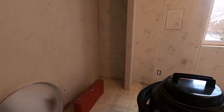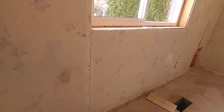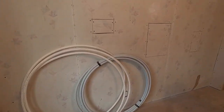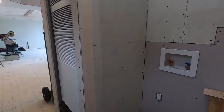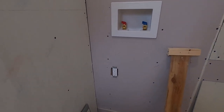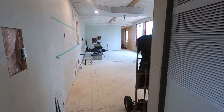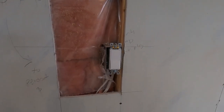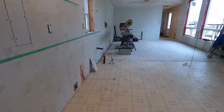We've gone through the whole home and changed out all the old switches and plugs to Decora-style outlets. I usually do that after the first coat of paint, but in this one we had quite a few electrical issues to sort out, so I wanted to make sure everything was correct before finishing the walls. We've relocated the washer plug and the dryer plug to work with our new modern machines. Here we also added a switch for the security lamp — you can see how the wires are run behind the drywall and come up from underneath.